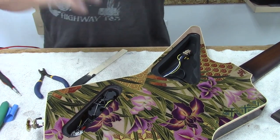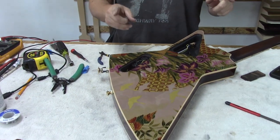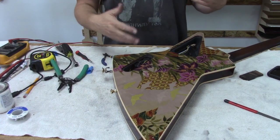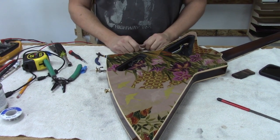We've got everything back together and hopefully this should take care of it. All we've got to do now is put the covers back on — which are shielded with metal tape — and it should make one big shielded box. It's called a Faraday cage, apparently — some kind of X-Men thing — and it should block electromagnetic interference.